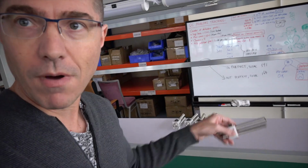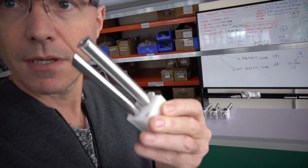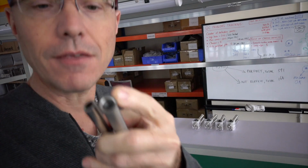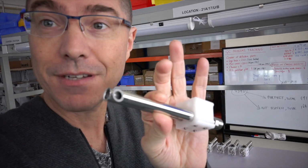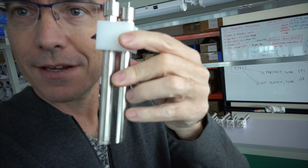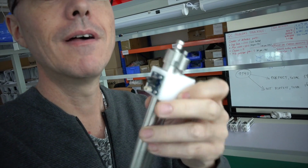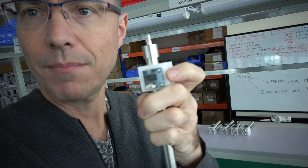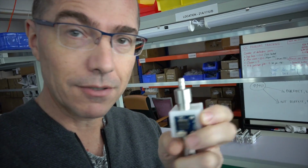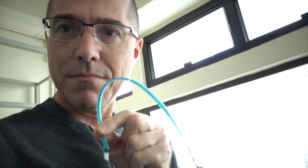This here is our water uptake assembly. It's got two tubes. The large one sucks the water up and it's got a particle filter on the end that you can remove if you ever get cat hair or something else stuck in it. The small tube here is our water pressure level sensor. What it does is it measures a column of air pressure here in order to tell how much water you have, which goes into a tube to this little circuit board here, which then digitally talks to the main board to give the water level. Every tube and every wire has a unique color. That makes repairs much easier.